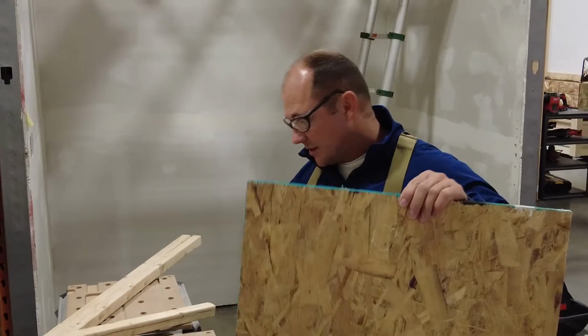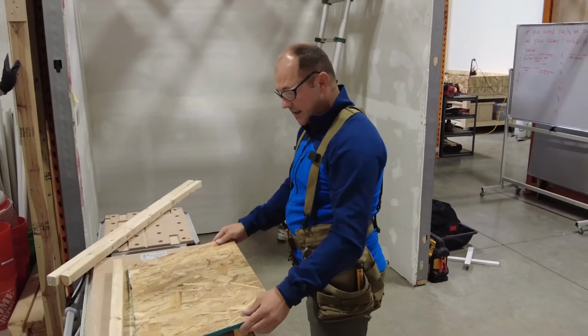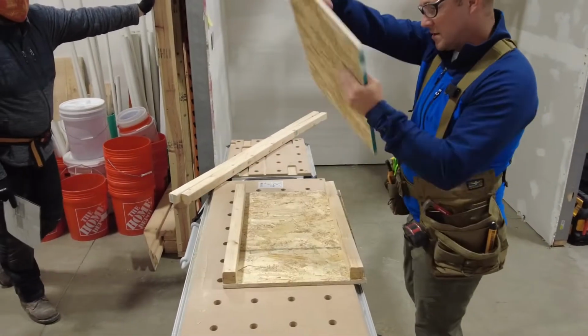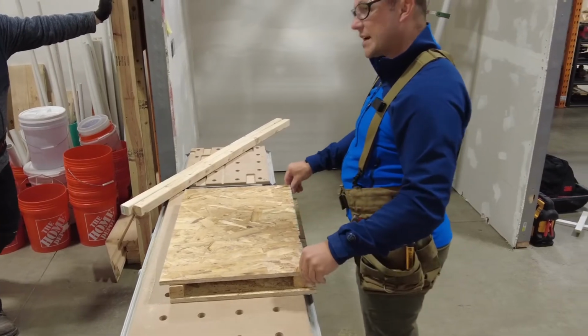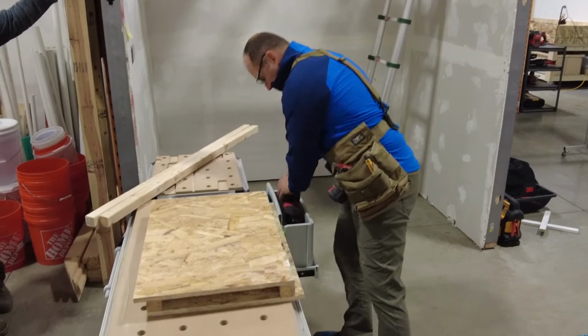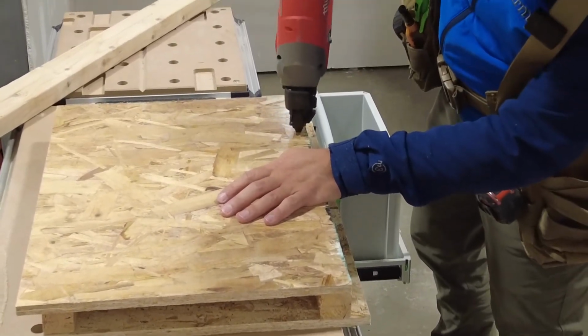I'm going to use this as my block for here because I don't want this at an angle when I'm trying to nail it, right? So again, I put them in there. It works out. I want my green side. Again, use the straightest sides possible, okay? So just a little bit on each side. This gun, you push down, pull the trigger. Push down, pull the trigger.